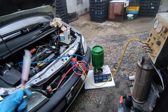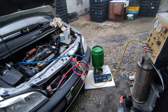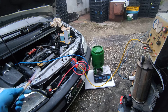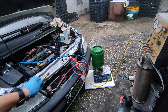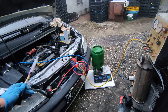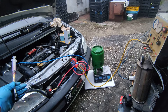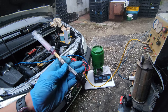I want to show you today a car that has an air conditioning problem. I haven't seen the problem yet but I know it will exist because you can watch my other video. The problem is a leak. I changed the condenser on the front, I changed the seals, and I changed the seals on the compressor. Unfortunately when I do a vacuum test and pump it up with 10 bars, after half an hour it's 9.9 bars — so there's a little leak somewhere that I can't see with bubbles, and that's why I'm going to use this.